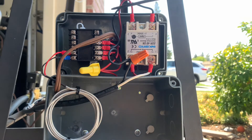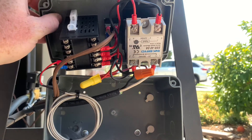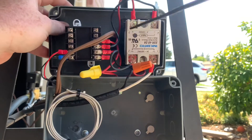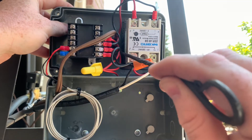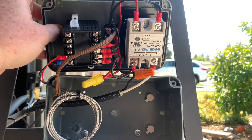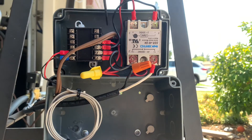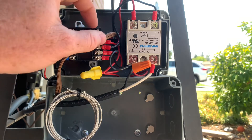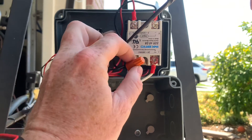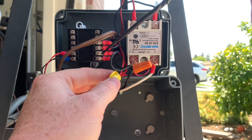That first brown wire is simply a 110-volt electric extension cord that I cut, long enough to reach the wall. It goes into the toggle switch, then I have two outputs going from the toggle switch into the PID control box. There are also wires going from that yellow wire nut into the SSR, and the black wire into the orange wire nut coming off the solenoid. The other leg of the solenoid gets tied into the other side of the SSR. There are two wires specifically for the SSR on the PID controller that go into the positive and negative of the SSR itself.